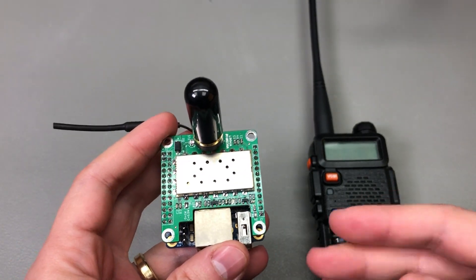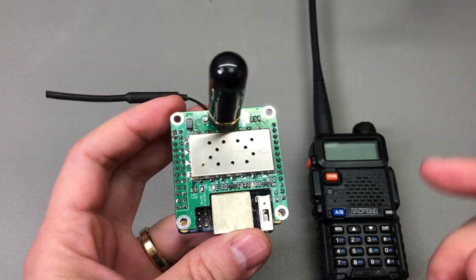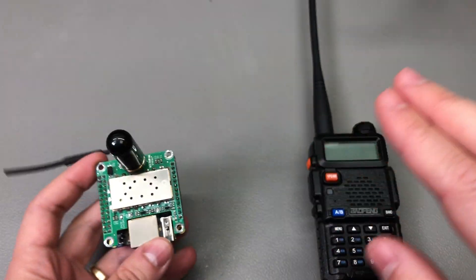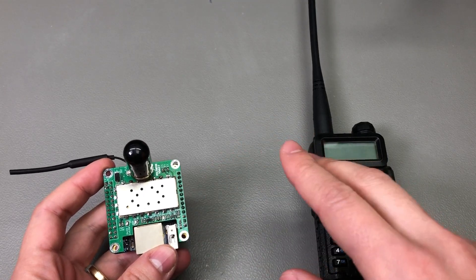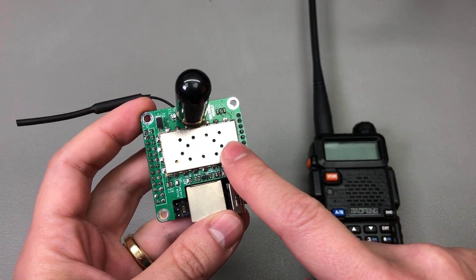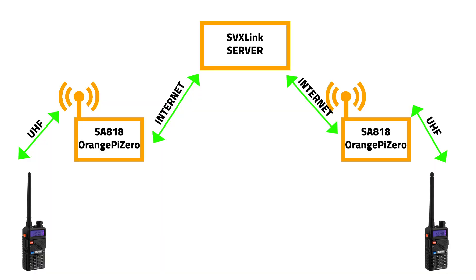To give you a general idea of how the whole system works, this repeater has an analog radio side which interfaces to your radio via UHF or VHF depending on the type of radio module you use. On the other end you need a way of interfacing all of that analog radio traffic to a digital network that interconnects similar nodes into a bigger network. That part is usually handled by an SBC, a single board computer.